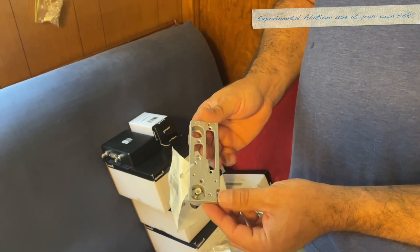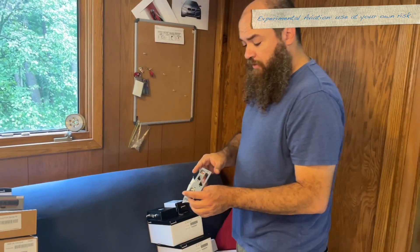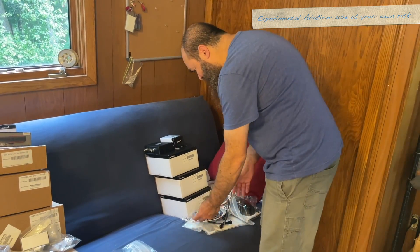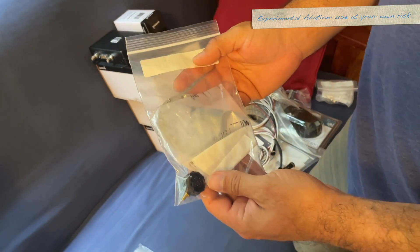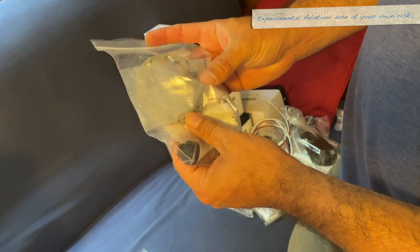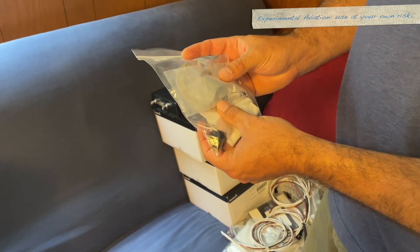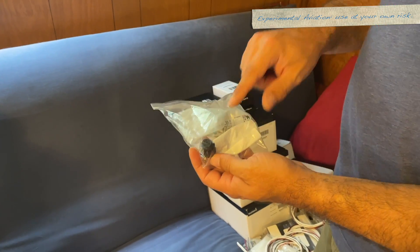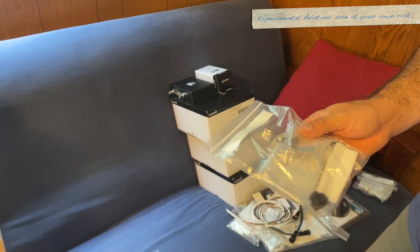I think I've got pictures online of where I installed it. So that's as much of that as you're going to see. This one is sort of fun — this is the GMU 22 installation kit. It's got this little bracket and includes a couple of screws. I believe these are brass screws — yes, brass screws because it's a magnetometer, so you don't want magnetic stuff around it. And it's got a circular connector instead of the regular D-sub connectors, so a little different.